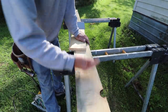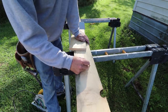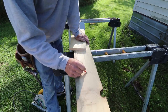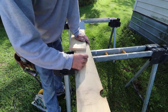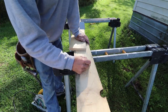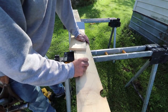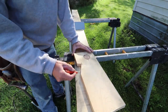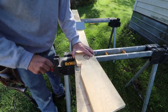Yeah, I know I'm going to do 2x6 rafters, so my rafter will come up. I'll just have a 2x6 there for the ridge, and it'll come down this side. What I need to figure out is, here is the roof on the actual workshop, and then we have our piece of metal that I'm going to slide underneath. I need to figure out how far down I have to have this rafter so that everything works out, and then I can figure out, I know that I'm going to have a little 3-inch bird's mouth here, and I know that my wall is going to sit right here.